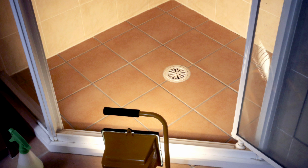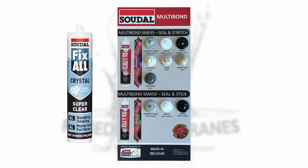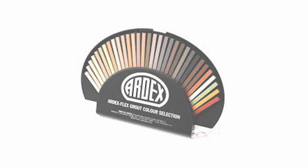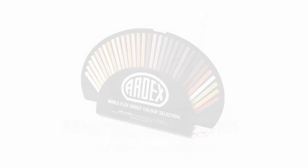Now, is there any cracks or missing grout? If you need to repair the affected area in one day, then you will have to use either the clear or matching color MS joint adhesive to fill the grout joints. If you have more time, you can simply purchase a matching grout and grout in the areas that are missing. There is no need to scratch out the existing grout. Once grouted, you will need to leave the appropriate curing time listed on the packaging, prior to waterproofing.